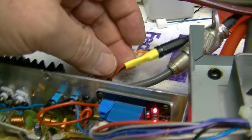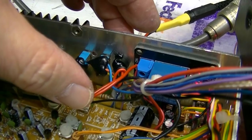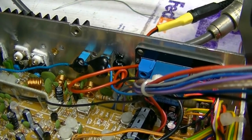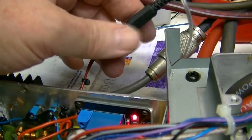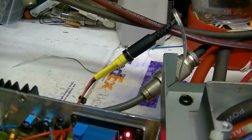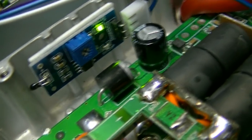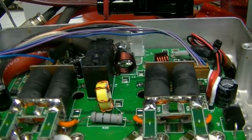I added a pigtail and mounted a connector outside of the chassis because I was going to put it right there, but the problem was I couldn't tighten the nut — once I put it on there wasn't enough room between there for the socket. So I put a pass-through and ran it out to a pigtail, plugged the fan into the pigtail. There's your relay, and here's the thermostat control. You can see it just kicked off — I've been talking on the radio to get it to come on.